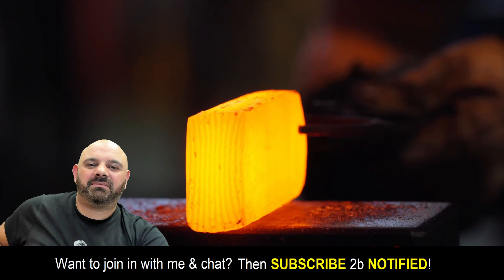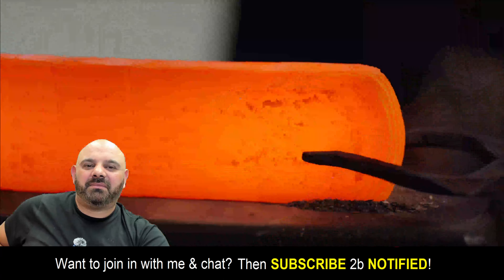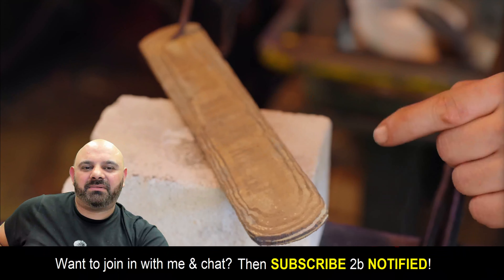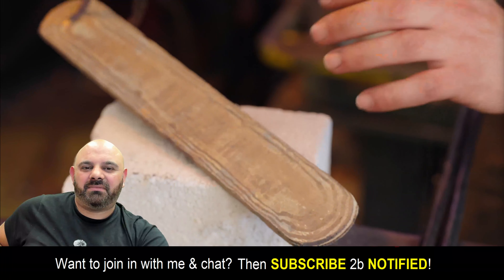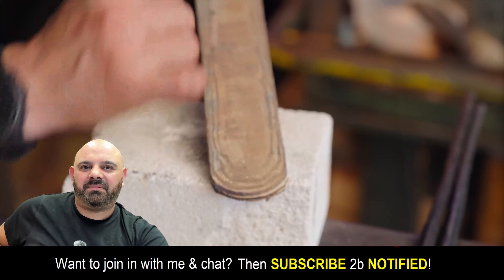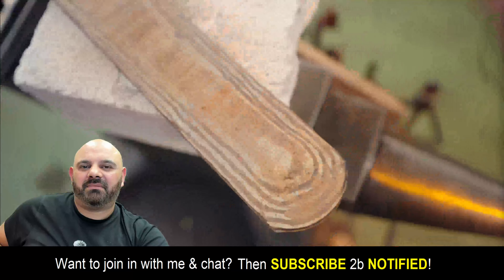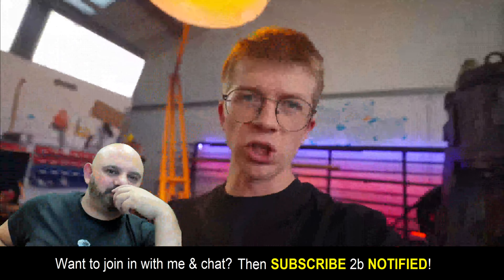That is so nice — I love forging titanium. I just got it forged out. So cool to see the pattern come through, but something kind of novel is happening here. You see how on the top surface we're seeing the layers? That's not really ideal — this is moving in a different way to steel. What's happening is the ends are squishing out further than the top surface. What I now want to do is anneal it. I googled how to anneal titanium and it seems pretty simple: heat to 700 degrees Celsius for 30 minutes and air cool it.